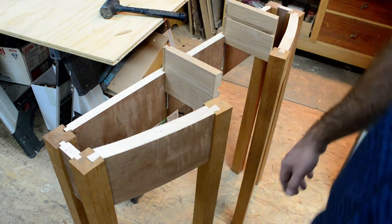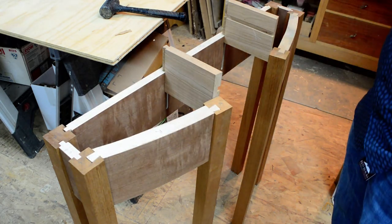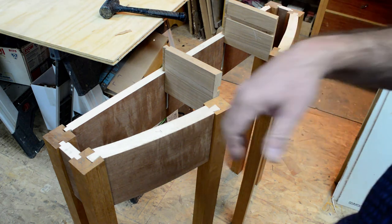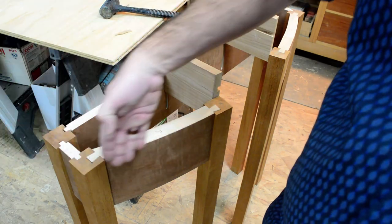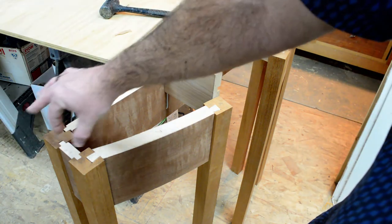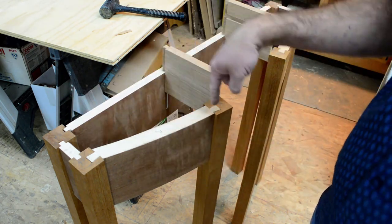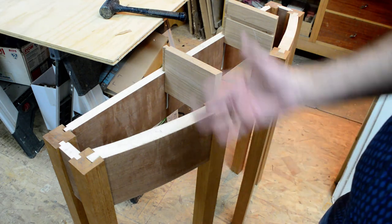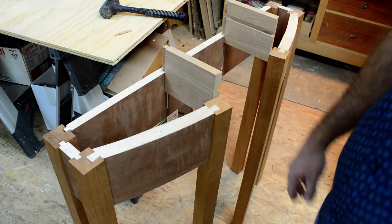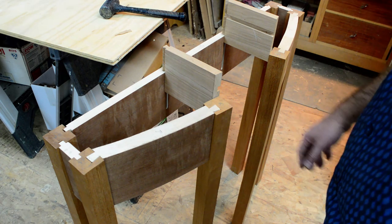As a side note, you might notice that there are six legs on this tiny table — two, three, four, five, six. This is an absurdly ridiculous amount of legs for such a small table. I did it because if I wanted a nice continuous curve that extends out to a really sharp point on the outside ends at the top, I'd need more than four legs. So I thought this would be a nice variation and I'm playing around with it. This is a really ridiculous tiny little apron, but we're going to see how it goes.